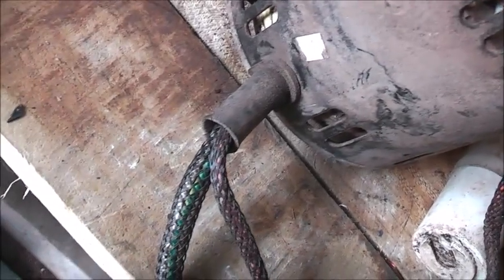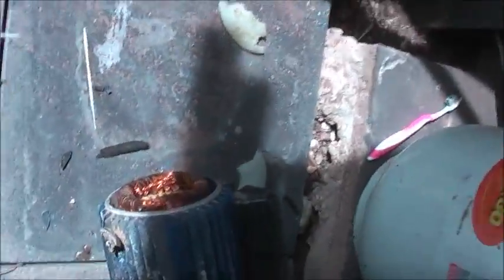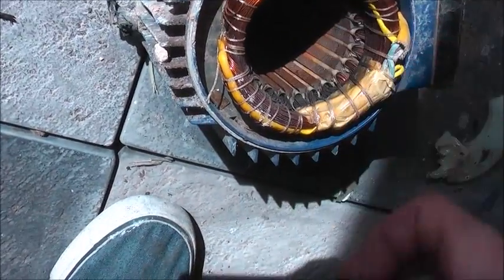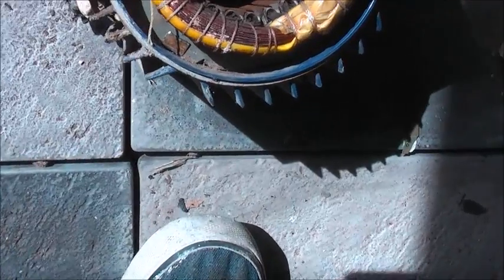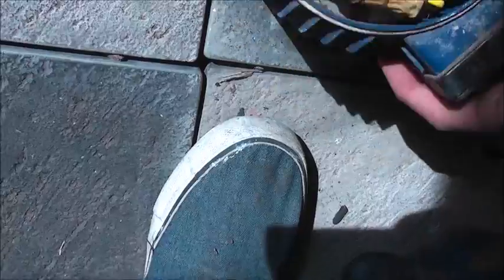It's a shame there's no electric motor manufacturing in Australia anymore - it all lies in China. Speaking of which, this is a Chinese-made CMG I scored. I picked this out of the scrap metal bin yesterday. It's a burnt-out sewer pump from 2002. There's a very slight burning in it - didn't burn out much, just slightly charred, then went short and arced a little bit. Looks like it arced and flashed a bit and shorted, tripping out the RCD.